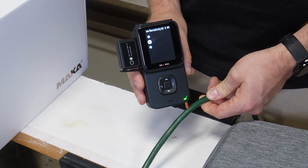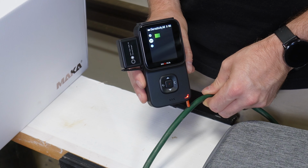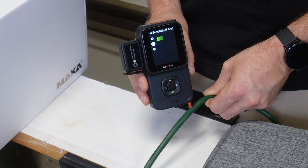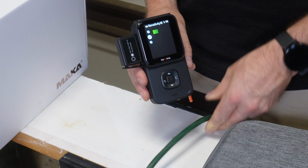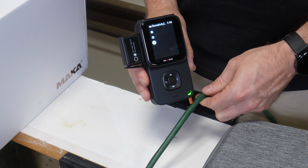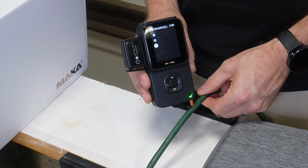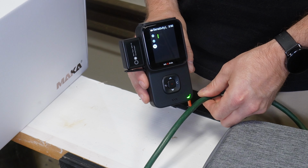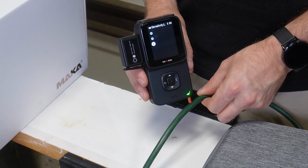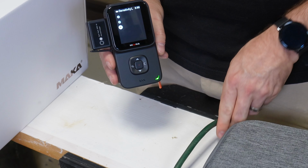See now, not even giving me anything on medium, but if I flip the cord around, it even tells me kind of what side of the cord the hot conductor is in this cable. But that's on medium sensitivity. So on low, barely registering, the LED's not turning green, and the meter barely affected. So looks to me like maybe you don't want to use the low sensitivity on this particular device, at least with an extension cord like that.